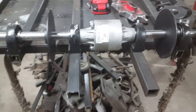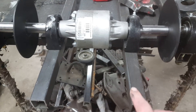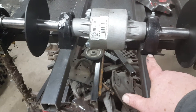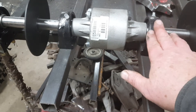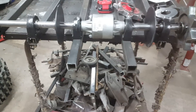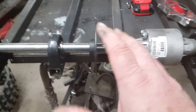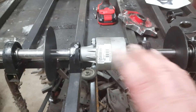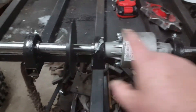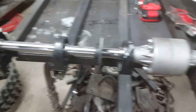Since last time, I got to thinking about the frame support, so I went back and drilled the holes one drill bit bigger. They're a three-eighths-inch hole exactly — drilling exactly will match the pillow block bearings — but I made them both a little wider so I could center the whole axle. I want the pillow block bearing to be centered, with nothing twisted or out of joint. By opening those holes up slightly, as I weld the brackets and braces across, I can stop and make sure the axle is still turning nice and free before I fully crank the pillow block bearings down.